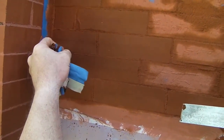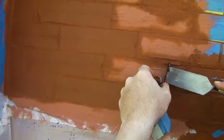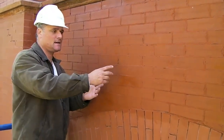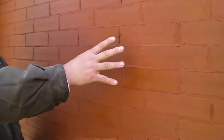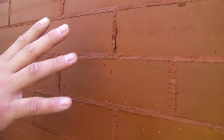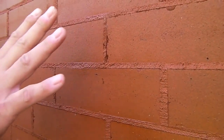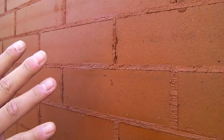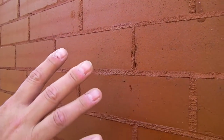If you let it spread to the joint it'll dry out the joint. We've now finished the grouting process — you can come in and look at the close-up of what it looks like after we just pulled the tape. We applied water to the surface of the wall to prevent it from drying too quickly so that the grout cures slowly.